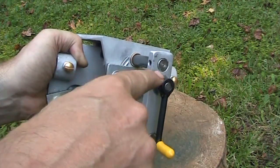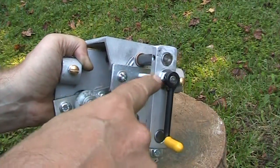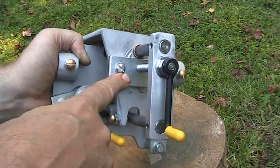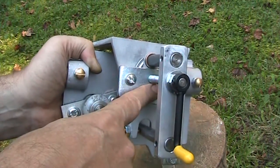So those are the main two points I was addressing in my retrofit: put a brass bushing here, drill it out, put a brass bushing for three-eighths, and add this plate here. Those are the two main improvements I've made to this design.